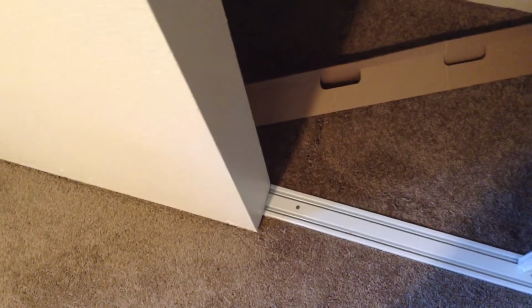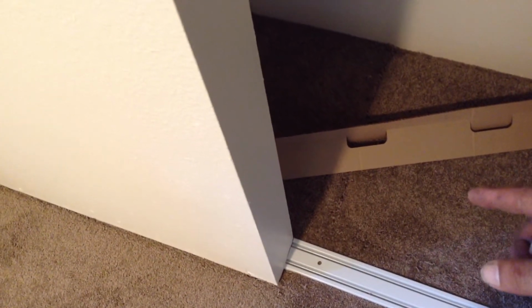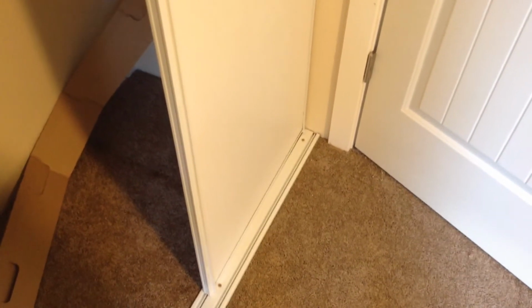The instructions that came with this weren't entirely clear about the spacing when you're having to improvise the positioning. They showed this thing positioned toward the front. They wanted this thing positioned back a little bit, but it wasn't really clear to me how far back in relation to the front and top, but now I realize it does need to go back. So if you're using a back alignment, then that ends up off the edge, right? Because we can't move this forward anymore because of the way these nailer blocks are, or if we didn't move it forward, it would only be a very short distance. So the lower actually needs to offset a little bit to the rear in comparison to the upper. And that's basically the theme on this.